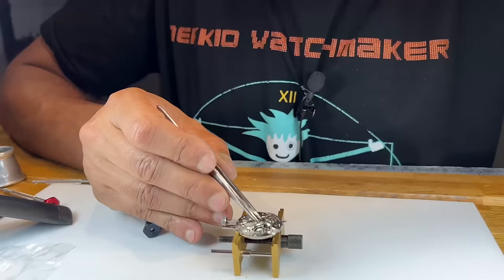I've been using the stitch mop to get the marks off the curved bit. Just needs a little bit more. So instead of mounting it on the lapping machine tool, because of this crown, I mounted it onto my lathe so I can get it. So I'll remove all the big scratches using the stick and then I'll finish up with the mop.